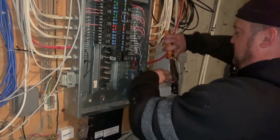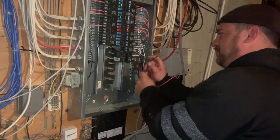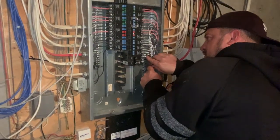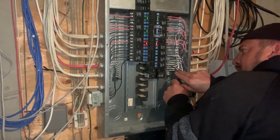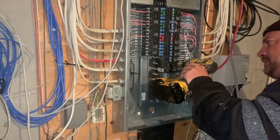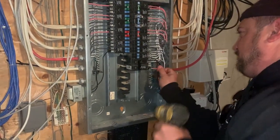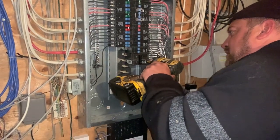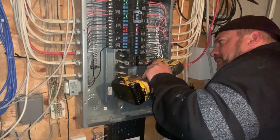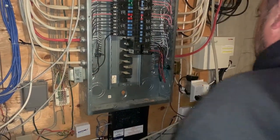You'll see I'm doing this with a pair of lineman's pliers instead of strippers — you get used to using lineman's pliers after a while and you can learn to strip wire quite easily without damaging it. I have to back these ones off — they're tightened already. Give your wire a good tighten and a good tug on it to make sure it's not going to come out. You don't want any loose connections because then you get arcing — and arcing is not good, it can cause fire. Give it a good tug.